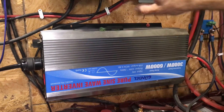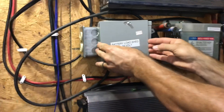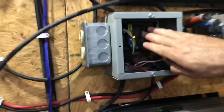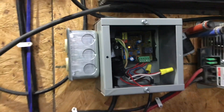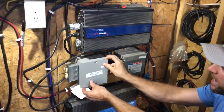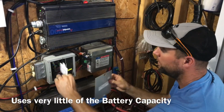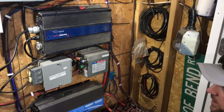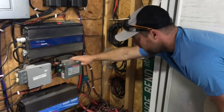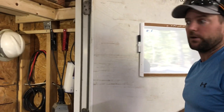When we're out of town, we've got this little contraption. You can adjust the voltage and the time delay on it. I have it set to come on at 28 volts and cut off at 25, so it basically only works when it's sunny and uses very little battery. That way when we're gone, we can leave the air conditioner on and it won't run the batteries dead — everything else like lights and power still stays on.